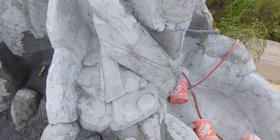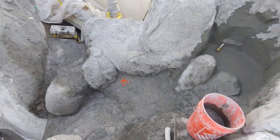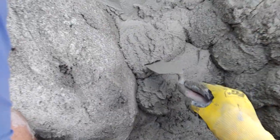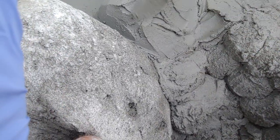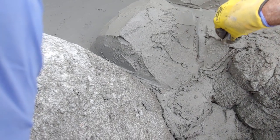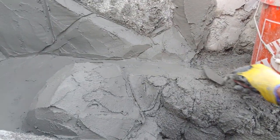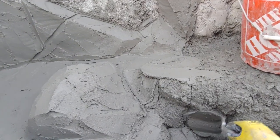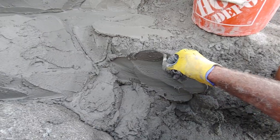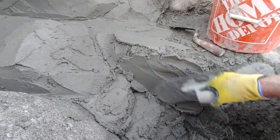It's late in the day — spout, not sprout. I've also got a valve that redirects some of the slide water. I noticed there was some rebar in here so we want to get something going on that — protection over the steel. This is a cream coat application. I noticed this wall was getting thin with the chicken wire, so I'm going to beef that up with a good inch of this material and get this section built up.